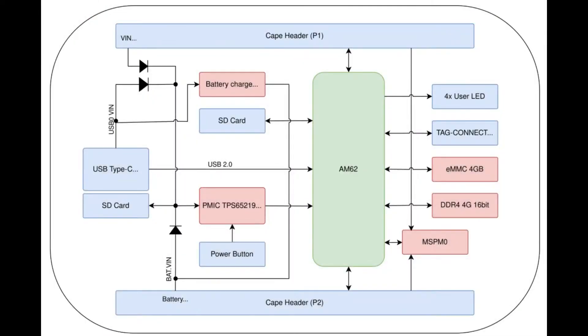There are ideal diodes inside — the LM73100, which is actually a chip I just got some prototypes for. It's got EMMC built in, so you don't need an SD card if you don't want. You can load flash memory onto the board. But there's also an SD card slot if you need more storage. There is a power management IC, and USB Type-C that connects directly to the gadget mode of the AM6232. There's also USB host available, and battery charging capability built in — USB and battery, whichever is higher, feeds into the power management.